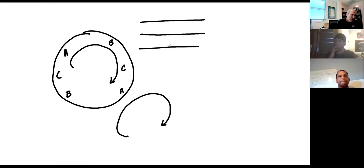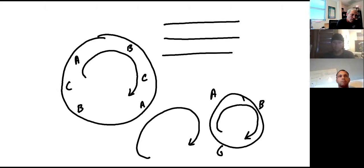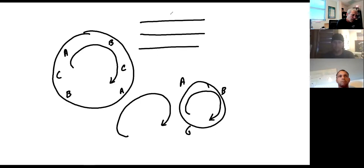If I follow my entire transmission system and my entire distribution system, and I then wire my motor with A, B, and C, it should match. My motor is going to rotate in the same direction. That's the plan, and that's what you want to happen out there in the world. But through all of my transmission and all of my distribution, can I keep the same configuration all the time? A, B, C, A, B, C? Probably not. No.